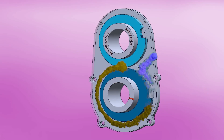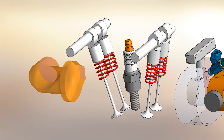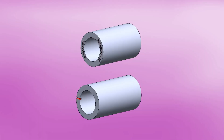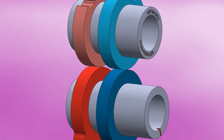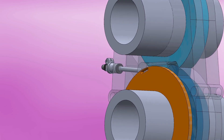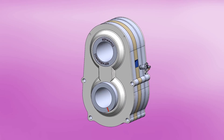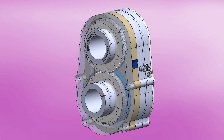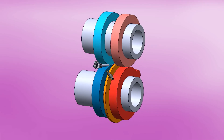As for parts count: there are no valve springs, which are heavy to press and subtract a lot of power — a very good thing for the Omega-1. There are no camshafts either, although there is the upper shaft where the two female rotors rest. One rotor performs intake and compression, and another handles expansion and exhaust, in addition to the intermediate rotary valve. Theoretically, since there are no seals, there's no friction either, which is most important compared to a piston engine. The use of titanium and hollow centers in the rotors keeps the engine lightweight. With a supposed thermal efficiency of 60%, it would not require large radiators, reducing weight and increasing reliability.